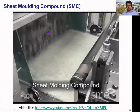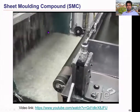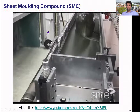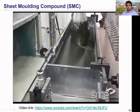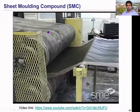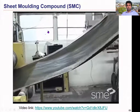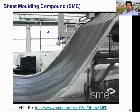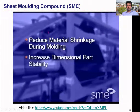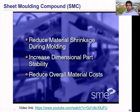Sheet molding compounds consist of two layers of resin paste with a flat layer of chopped and/or unidirectional glass fibers sandwiched between. Typical sheet molding compounds contain 30% glass fibers by weight. The resin pastes are typically either polyester or vinyl compounds. These compounds commonly incorporate fillers, additives, and other materials to reduce material shrinkage during molding, increase dimensional part stability, and to reduce overall material costs.